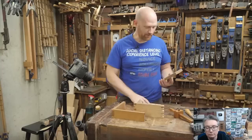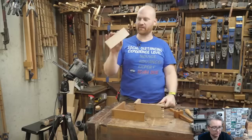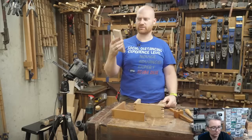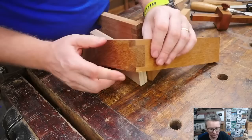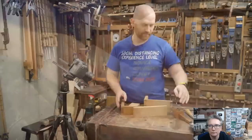Let's go ahead and dive in. I'm going to be making it today with two pieces of wood. This is white oak — actually, this is like a hundred-and-something year old white oak scrap piece. And then this is Filipino mahogany. It's a fairly soft wood, while the oak is a fairly dense wood, but they give a nice contrast between the two. So basically, what is a half-blind dovetail? It's kind of like a standard dovetail, except you can only see it from one side. The other side has a solid blank piece of wood, so you don't see it coming through — you're making a dovetail but only with half of the board.